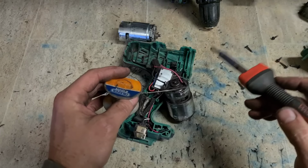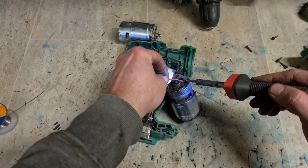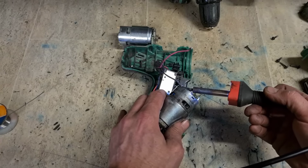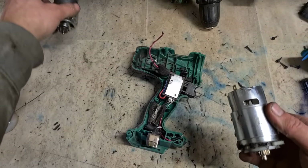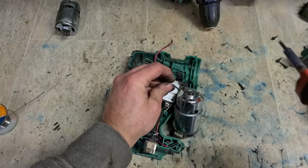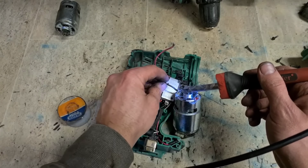The solder's difficult to melt. Just get a bit of regular stuff and mix it together. Put more on to take it off. And don't be shy. Plenty of solder on it.